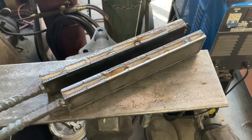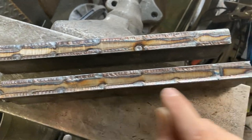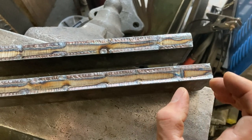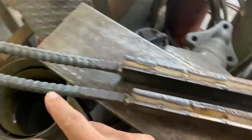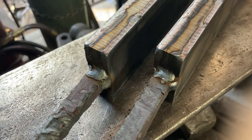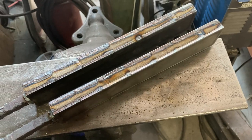Here we are having completely prepped these work pieces. You can see here, there's a cross weld here and one here. And in both cases, the shorter end, i.e. the weld closer to the end, is away from the handle because that's the tip. And then this is the larger section that will carry the bolster, and that is toward the handle. The handles both have cranked stubs for directionality, better control. We've just got some fusion TIG all the way around. And then MIG weld handles on for strength. Chamfered handle ends. And these bad boys are ready to forge weld.